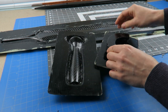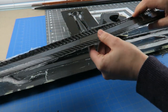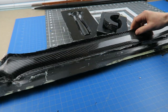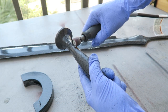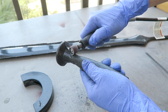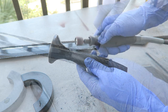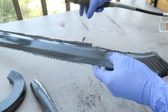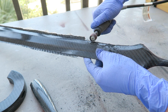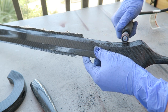When they come out, now they need to be cleaned up all over again with that extra edge that's quite rough, so I used the Dremel to remove all of that excess material and get those seams as clean as possible. And this is why there's no point in repairing any imperfections before joining the parts, because at this point I'm adding additional scratches and whatnot, but this will all be taken care of after we have the structural elements addressed.